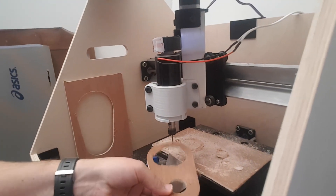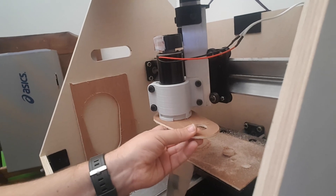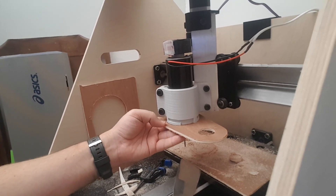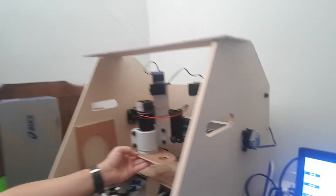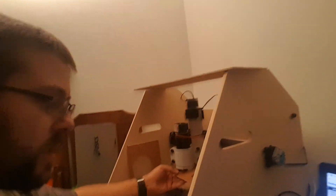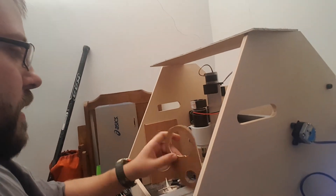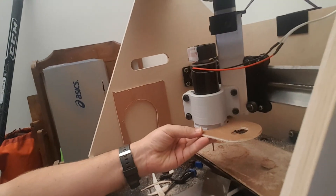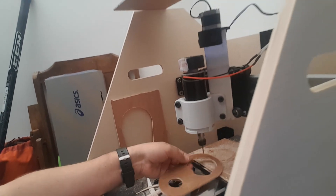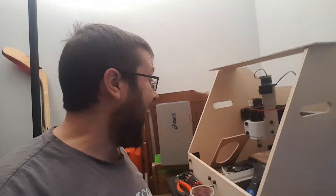Let me make sure the camera is pointed where it needs to be. If all goes well, this should install like that. My measurements are off — I think I need to make these teeth slightly less wide. That's okay, it's just a test piece. We are very, very close. I need to make my outer diameter just a little bit bigger and the teeth themselves just a little bit smaller. The idea is it clicks on like that — clunk — and locks into place with the vacuum cleaner attached to the front. Success!